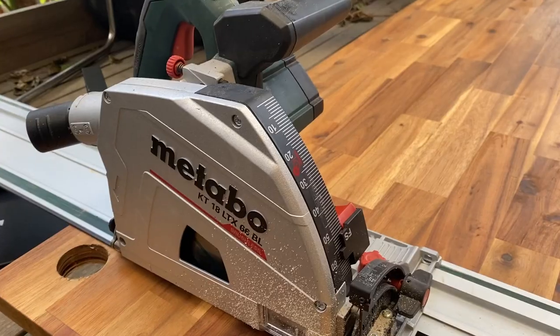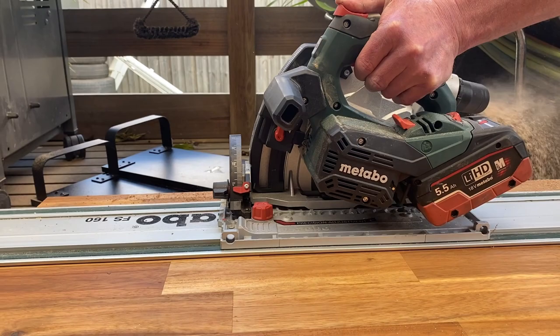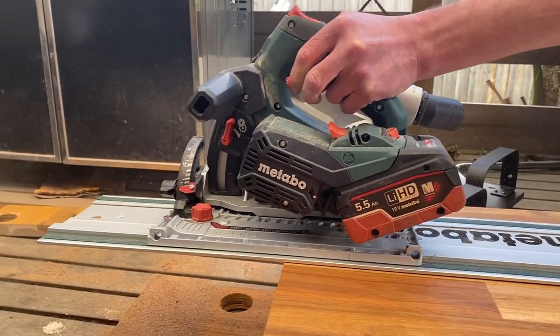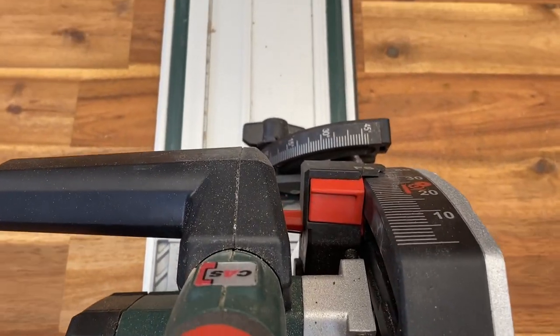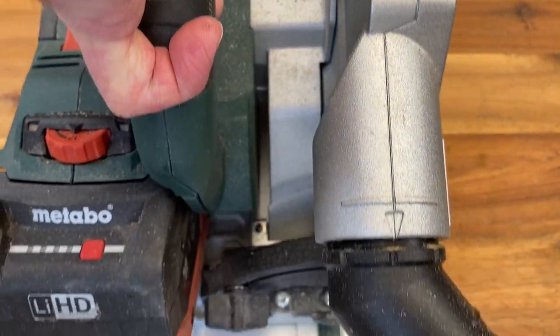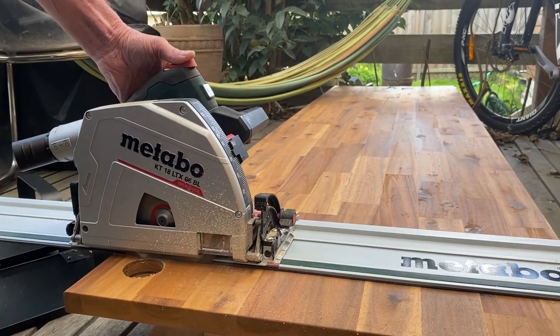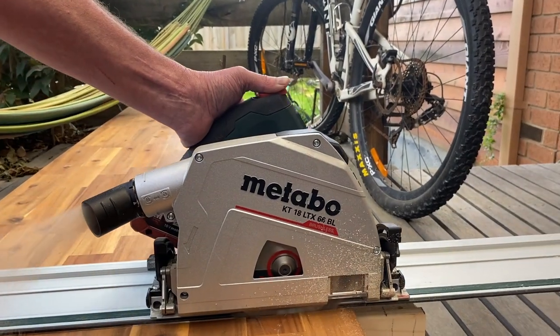The depth adjustment for the blade is nice and easy — anything red seems to do something, which is very similar to Bosch. Is it a European or German thing? The depth adjustment's really good, and one thing I really like is there's a micro adjuster on the top as well. So you plunge it in after you've set your depth, and if you want it a mil shallower or deeper, you don't have to play with the big adjuster — you just wind this little knob. It's easy to get to. If you're working in really precise bespoke materials, that would really come into its own. I've never actually seen one on a track saw before, and we've done three or four now.